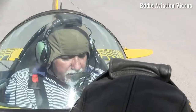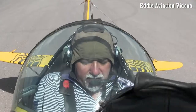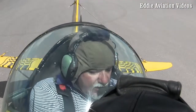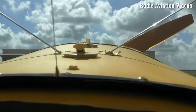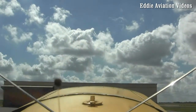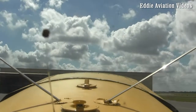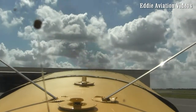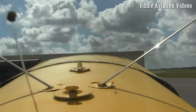It's a fuel-injected aircraft. The first thing I do is turn the master on and give it a little bump of fuel with the electric fuel pump to get fuel up to the fuel injection unit. Turn it on for a second, then turn it off. Turn my mixture to full, barely crack the throttle, and hit the starter with my feet on the brakes and prop clear. He started right up. I make sure my oil temperature and oil pressure are okay and everything's where it should be, and we can start taxiing to the runway.